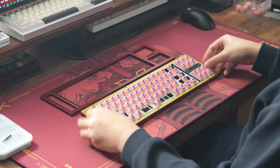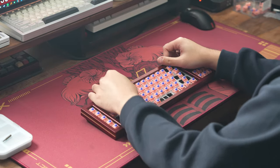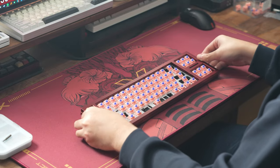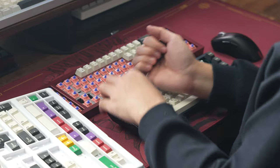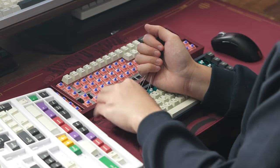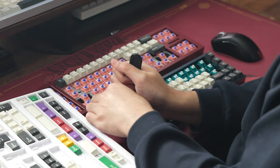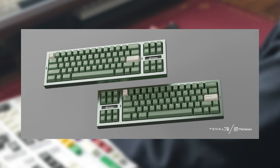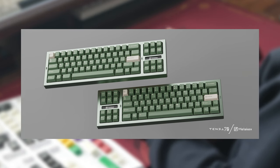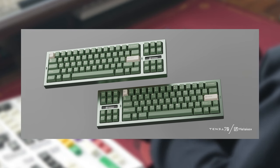When it comes to ease of building, this isn't at all difficult or complicated to put together. Daring Run provides a really well-detailed build guide that makes putting this board together super straightforward — just lube and tune your stabs, pop them on, put your plate assemblies together with the gaskets, and close up the board and top it off with your keycaps of choice. Super simple. The ability to build the board in a southpaw config is a really neat feature. The last time I saw a board try this was with the Tenet 70 by MetaKey, but that board costs more than double, even triple this DR-70F, so I'm really glad that a niche feature like this finally made its way down to a more budget price point.